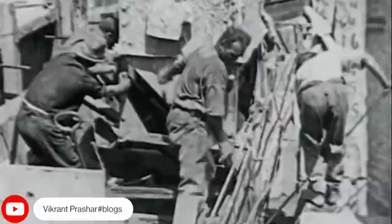The granite for the pylons was quarried at Moruya on the New South Wales south coast, where a temporary township was set up. Work commenced at the site in 1924. To shape the rock, lines of closely spaced holes were drilled. The granite was then split and scabbling machines worked off the rough. Final shaping took place in the workshop. As there were not enough granite masons in Australia, Dorman Long brought them from Italy and from Aberdeen in Scotland. At its peak, the Moruya quarry employed 250 workers.